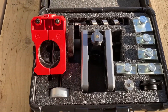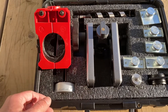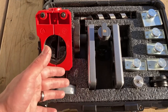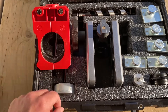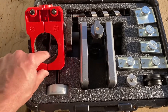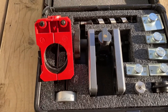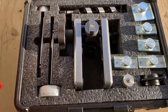In my experience, if you can do a pilot hole, great, this will get the job done. But if you need to make a hole bigger for a deadbolt or a lever that wasn't cut to proper size, and you need to expand that hole and you have no place for your pilot bit to go, it just rattles around and this piece will actually shift on you.